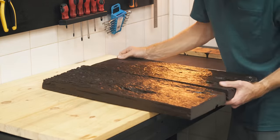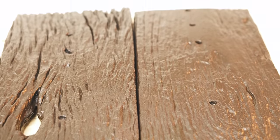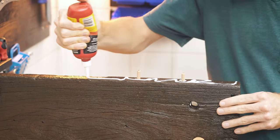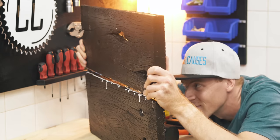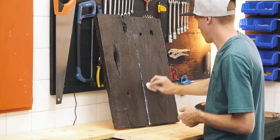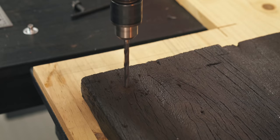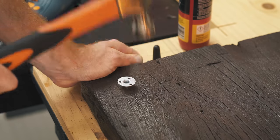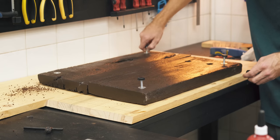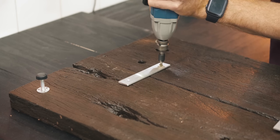It was a challenge to join the two pieces in a way that would be strong and neat, since the gap between them wasn't very consistent. A mixture of a dowel pin where you won't see it and wood glue got the job started. I also added height adjustable feet so that the base is slightly off the ground — and more importantly, I can compensate for a skew base if needed. Finally, I added some aluminium reinforcement strips for peace of mind.